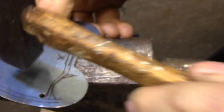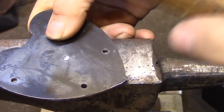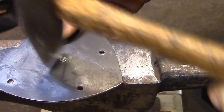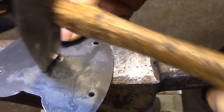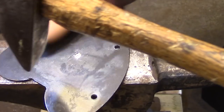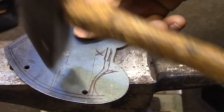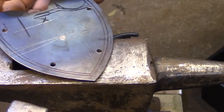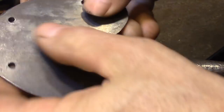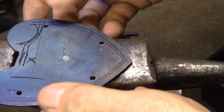This kind of thing was quite common on really old locks. I have a lock from the 1700s where they underestimated the size of the block they needed to hammer out the plate, so they just forge welded another plate on the corner to make it the right size. It's a nice reminder of how much work was involved with just getting the raw materials back then. If sheet metal was available it would have been very expensive, so apprentices would hammer out the stock needed, and if they miscalculated they just welded on another little corner rather than scrapping and starting over. Here's the rivet completed - later when I sand these plates smooth, that rivet head is going to disappear and blend in with everything else.